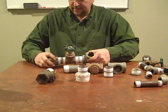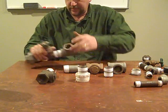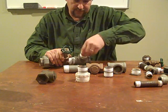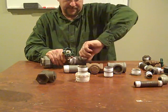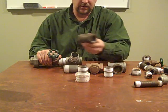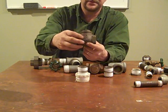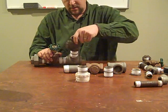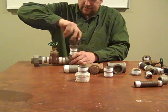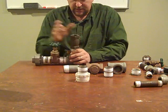Putting in a T. Now I get to the waste valve or impetus valve — it's the valve you're going to hear thumping away like a heartbeat. The swing check valve: you want to make sure on every swing check valve there's an arrow, and the arrow has to point down. The water is going to be picking up and wasting out of here and hitting and stopping and rebounding. We'll show you that when we actually start this up.